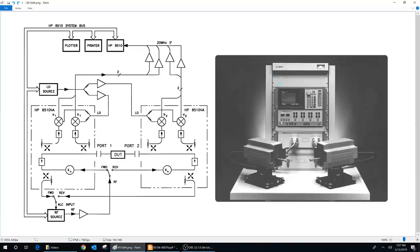Here we have the HP 8510, a full-fledged network analyzer that used to go up to about 50 GHz. Its architecture evolved into the PNA-X which Keysight sells today. There are two ports at the bottom and the S-parameter test set at the back — that's where the RF signal comes out for measurements up to 50 GHz. With the millimeter wave extender module, you have access to the LO, RF, and IF signals directly, and you can connect them to these external modules to extend the frequency range up to 110 GHz.